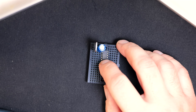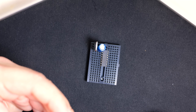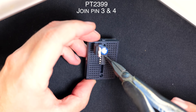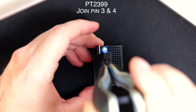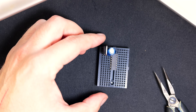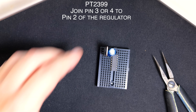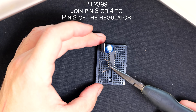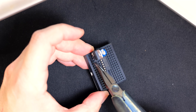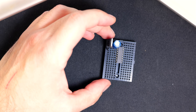Now I'm going to sort out all these grounding points first. Grab a bit of a resistor leg and bend it. So now I've got pin 3, pin 4 — they've got to be joined together. So you can see 3 and 4 are joined together now. I'll also want to join the ground from the regulator to the grounding point here. I've just got a small piece of wire and I've stripped it and put it in. Okay so now those grounds are done.